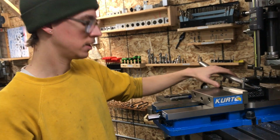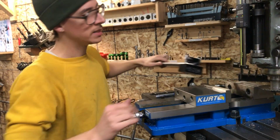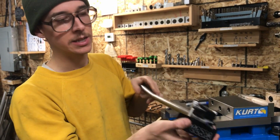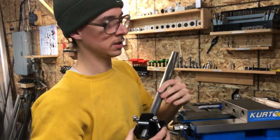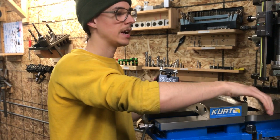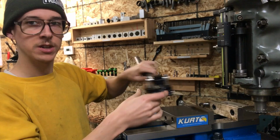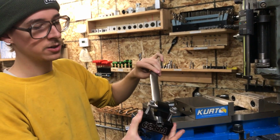Another thing I would say is when you're loading it in and out of the machine, especially after you've made some cuts, you're going to have chips around, and you just want to wipe off the face as always, because the aluminum is kind of soft, even with the anodized surface. That makes the skin of it kind of tough, but it's still aluminum, which is a soft material, and so you could be pushing chips in there. So like any machinist is used to, wipe the chips off of the surface with your fingers, and check for that every time you install it. That'll make sure that you have these nice, smooth, broad contact areas over time.